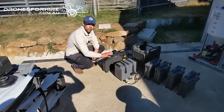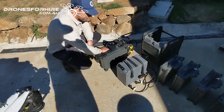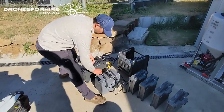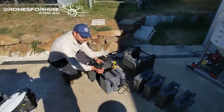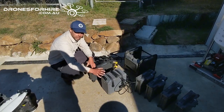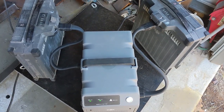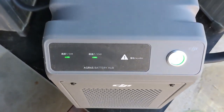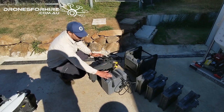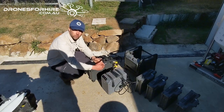We've got the C-8000 and we've got the C-10,000. The C-10,000 runs off three-phase power. The C-8000 has two 15-amp plugs. Two batteries can be connected to the C-8000, but only one battery at a time can be connected to the C-10,000. The C-8000 is not charging two batteries simultaneously — both inputs go into one battery to charge it as fast as possible. It chooses the battery closest to being fully charged, focuses on that one, and once it's finished it'll automatically switch across.